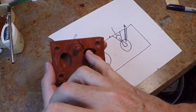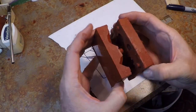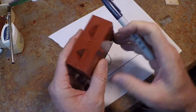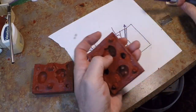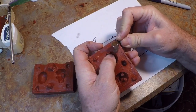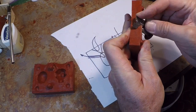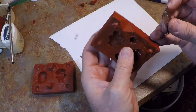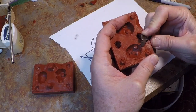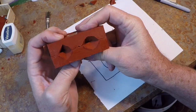So there are my sprues — one, two — and there are my vents — one, two. Now I'm also going to widen the sprue. When you pour the metal, you want a nice target. I'm not going to connect this notch to the sculpture itself, but I will just notch this out and that will make for a bigger pour spout for the pewter. The more pour spout size you have, the less you're going to spill when you're pouring — and it's not fun to spill molten metal, even if it's just good old pewter. So now put these together and I've got some pretty nice little target holes for my metal.